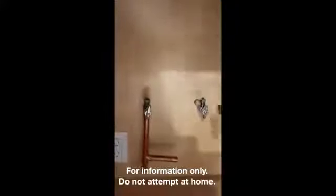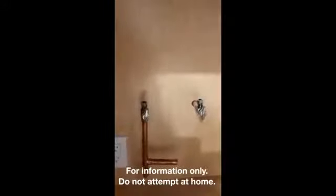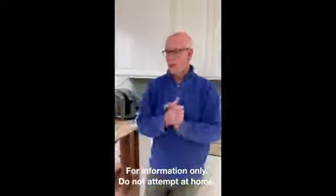The hot water is always on the left — that's an industry standard. So facing the front of the cabinet, the hot water will be on your left and the cold water will be on your right. There's another outlet for the garbage disposal because in this project we're going to have one, and that's a dedicated line too. What I mean by a dedicated line is no other appliances can be on that electrical line — it's only used for that fixture.